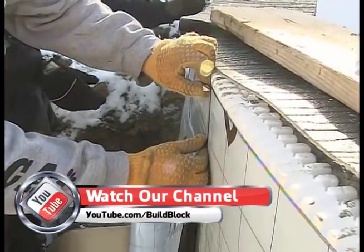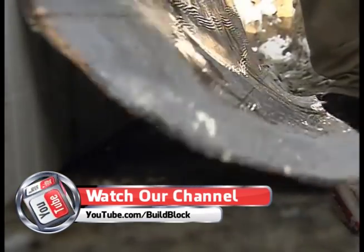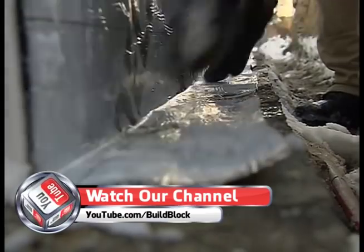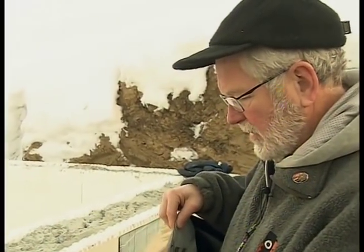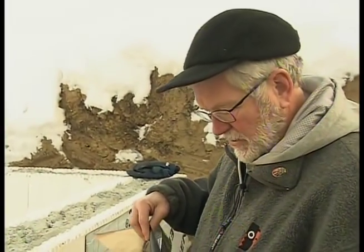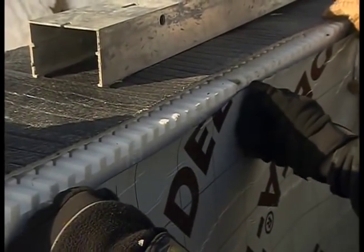A couple of things we're doing as we lay this: we make sure we overlap the last piece by about two and a half inches or so, and we're also overlapping the footing so that any water coming down doesn't get into the footing but is expelled off the side as well. Last time we built a house we did this double wall system and got a lot of grief for it — people said you could almost float this thing in the middle of a lake with so much protection. But I think that's the only way to go.